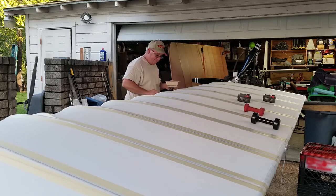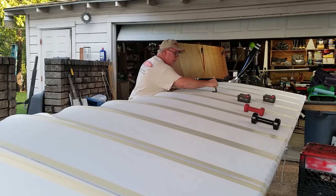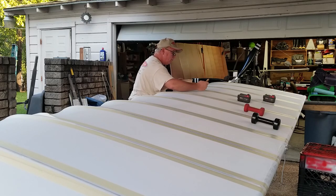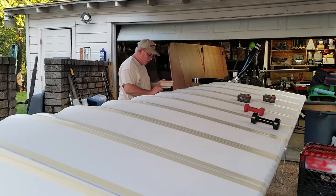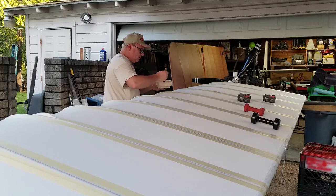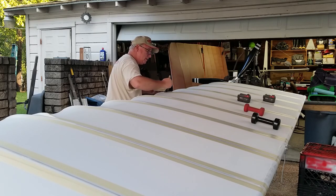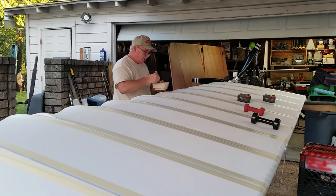When I say I have an extreme airfoil, I explained in some of my other videos how I did a combination of the aluminum airfoil and the foam airfoil. And let me say, what do I mean by that? Well, what I mean is I tried to use a thicker airfoil. And a thicker airfoil gives you more lift at slow speed.